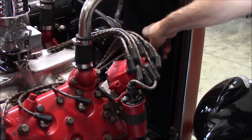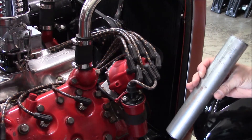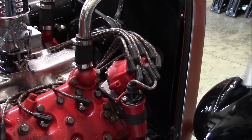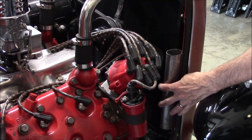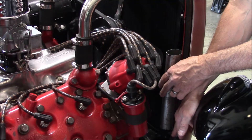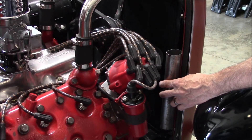My fan is pretty close to the sides. I still want to run a hood — all the sides were like three inches wide and stuff, so it wouldn't let my fan clear them. So what I did is I decided to make one. I took a piece of exhaust tube I had left over, stuck it in my vise, and kind of ovalled it a little bit to get just a slight more clearance. My plan is to put it right there. My fan will have about a finger-width clearance and my hood will still close. I can use the bottom mount for the radiator and shroud mount, and then I'll just have to put another mount up here and put a bolt through the radiator shaft — so that's the plan.